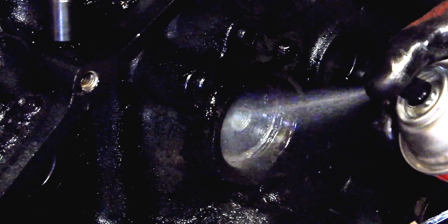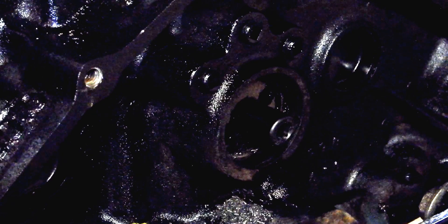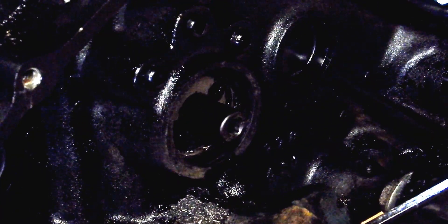I'm going to clean those threads and then take some brake clean and clean out this area where I put the grease and stuff, making sure to get all those shavings out. Now I'll put the drive in there — I'll probably lock-tight this eventually, but not right now just in case I want to shim it out like a sixteenth of an inch or something. That's the cam drive, and this kit I got came with a little seal so I'm going to put that on.